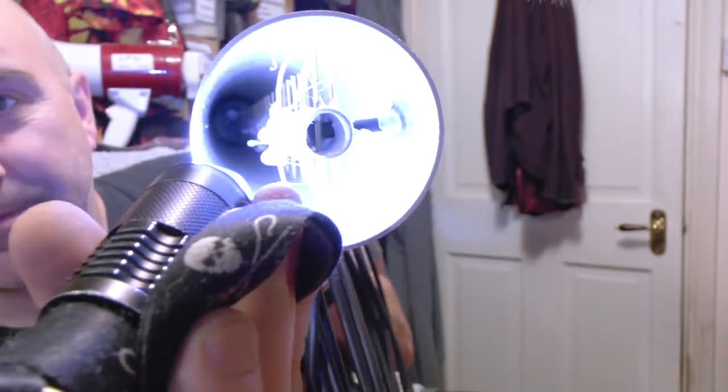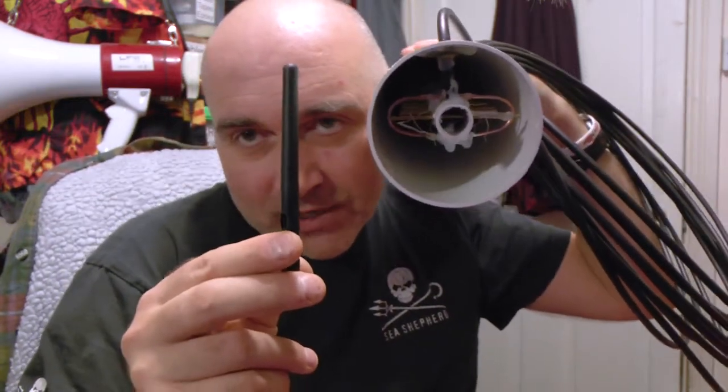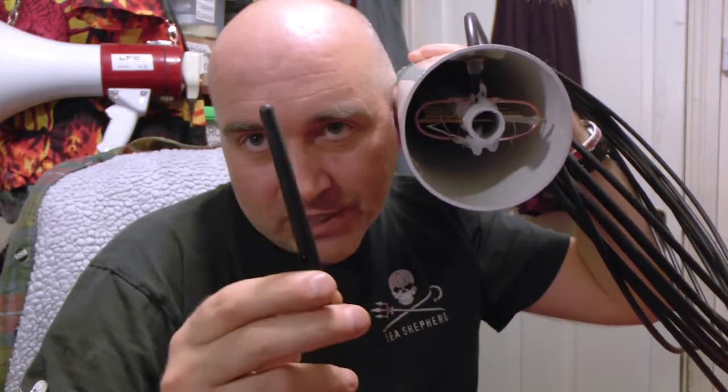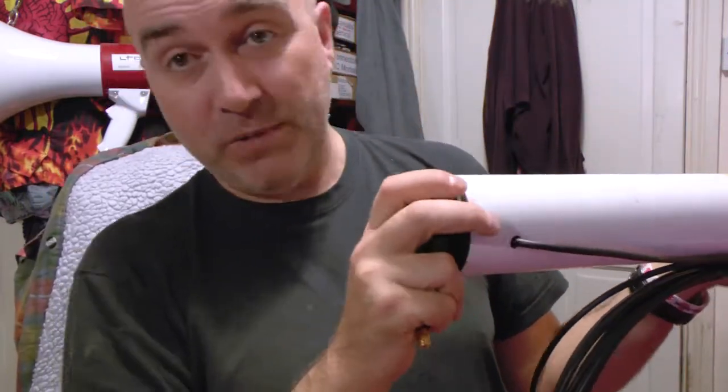These are known as Yagi elements, and notice they all point upwards. So which way do you think you'd have to have your antenna on your copter if you were flying with that? It would have to be upwards. And if you made the silly mistake of angling your beam like that sideways when you're trying to get a distant signal, you'd almost get no signal. So there's the science. You do not want to use one of these. They're incredibly, incredibly directional, and the difference between that and that would be 100% signal and no percent signal. So this is really only for specialists that know what they're doing, or radio amateurs, not well suited for copter flying.